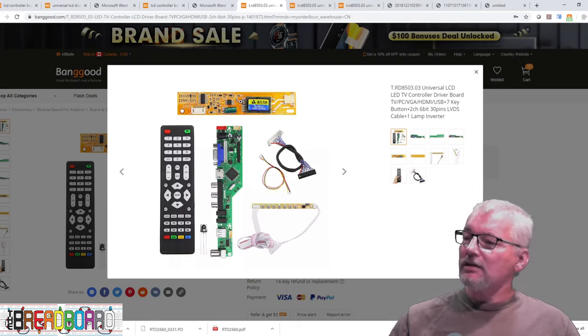They say to leave it for at least a minute. Even though I've got an 8-bit 2-channel cable hooked up, the display should ignore those extra connections. Okay, that should be good — we'll power cycle this again. I know this display was working earlier on this resolution. Let's try going back to what we had before — the extra wires simply won't be connected. Let's plug that in and power it up again.